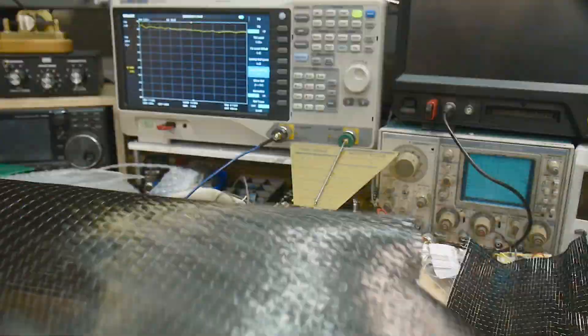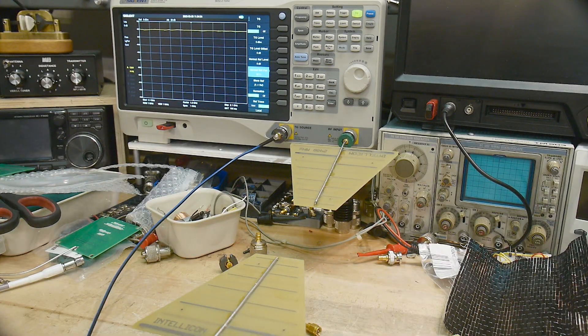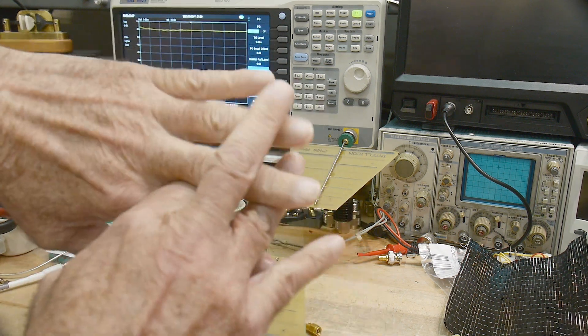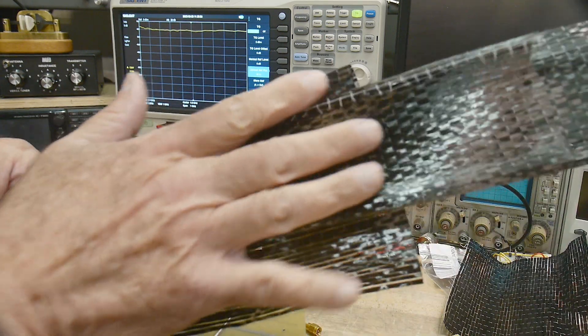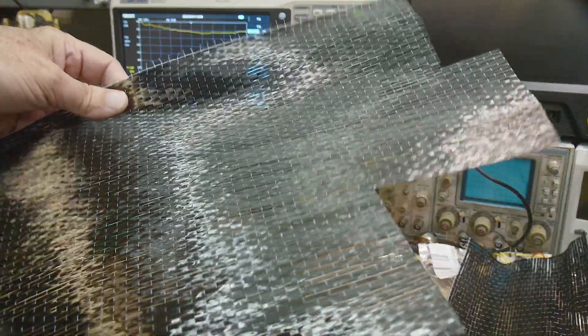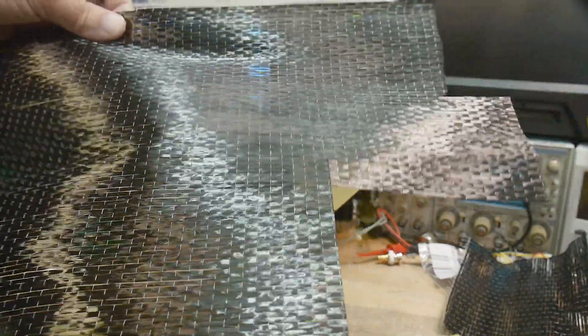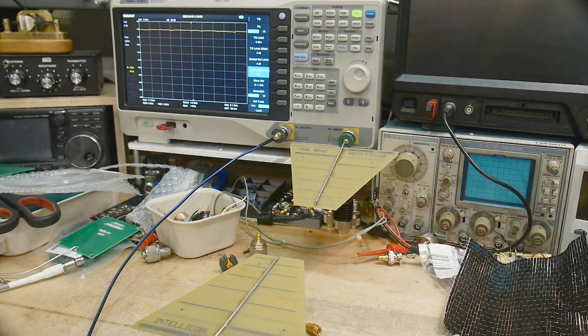If you're building a fiberglass thing, you can put in a layer of carbon fibers just to stiffen it and make it super strong. You can get carbon fibers that are woven together, but you can also buy carbon fiber with just parallel lines. This is called unidirectional carbon fiber sheet or fabric. There's a little bit of nylon stitching just to hold it together, but that's not conductive — the carbon rods are conductors, so they act like a bunch of parallel wires.